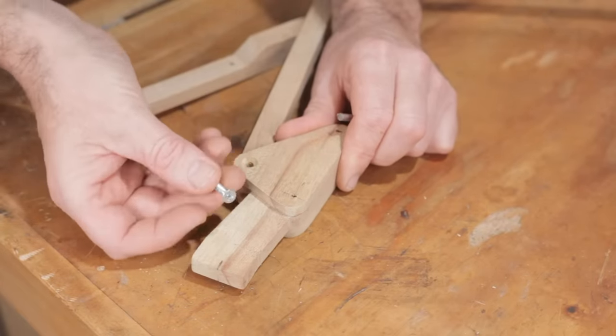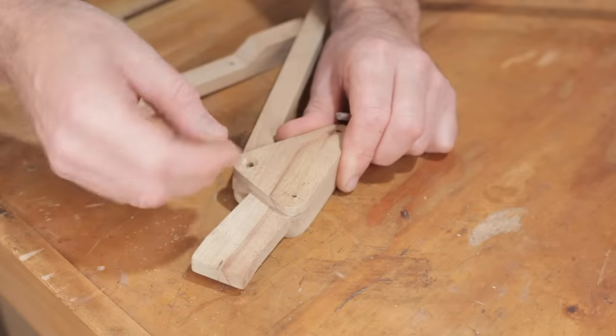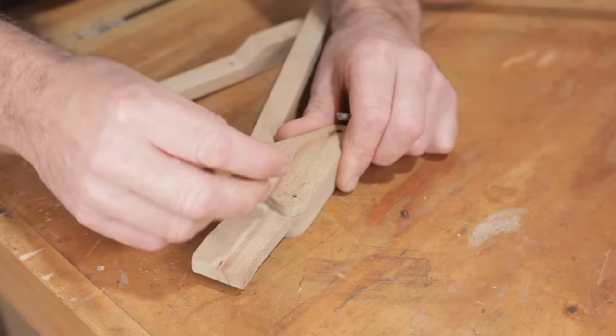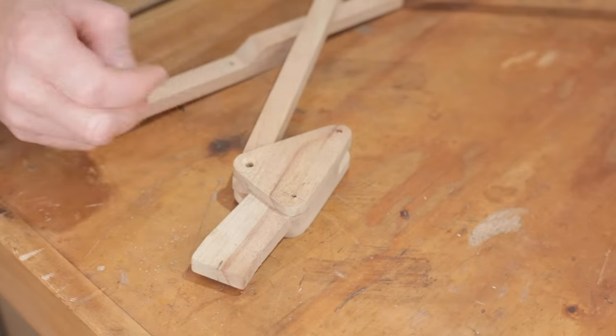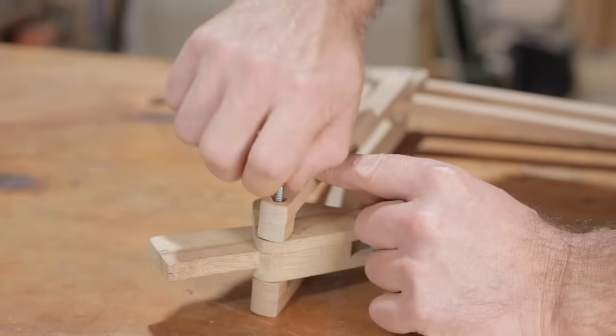But because my machine screws are 3/16 of an inch, I don't have any imperial taps. So I've just drilled that hole at 4 millimeters, and I'm going to screw that straight in. I've tested it on here, and that is more than strong enough for what I need.